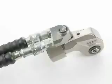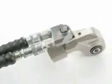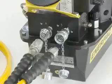Slide the sleeve down over the advanced coupling and hand tighten completely. Connect the male hose coupling to the return coupling on the S-Wrench, marked with the letter B. Slide the sleeve in place and hand tighten completely. Fit the hoses to the pump and follow the same procedure as with the S-Wrench.